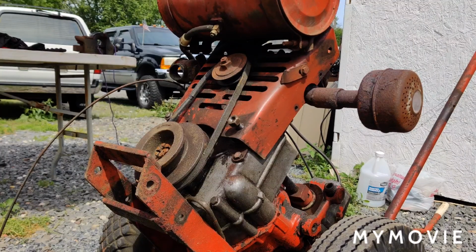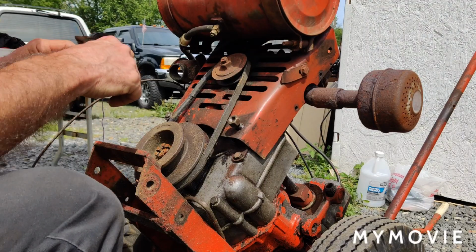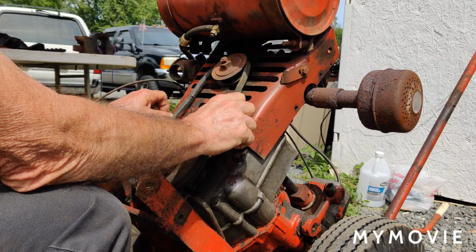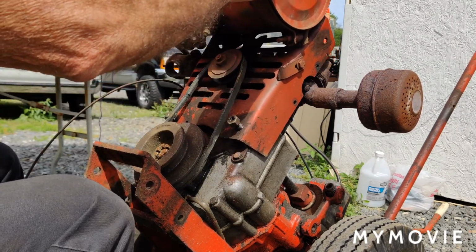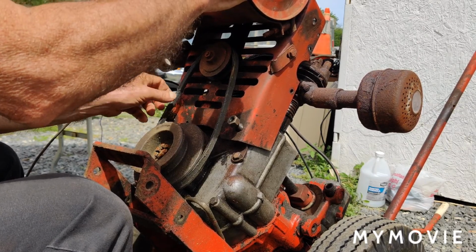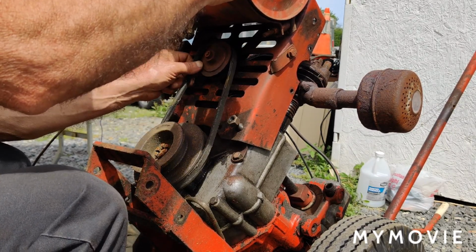Okay, it's been about a half hour now, and the Postal Gravely seems to be all right with the carburetor leak. So, on this one, I took the handlebars off. I took the shift levers off. I loosened these two nuts here that also hold the shroud on. So what we're going to do is pop off this ready-to-break belt here.